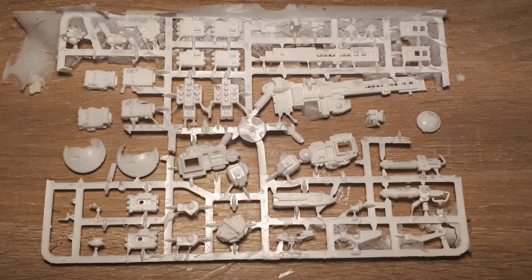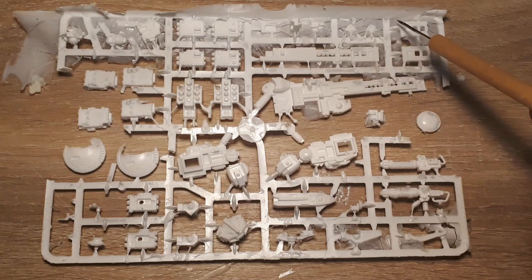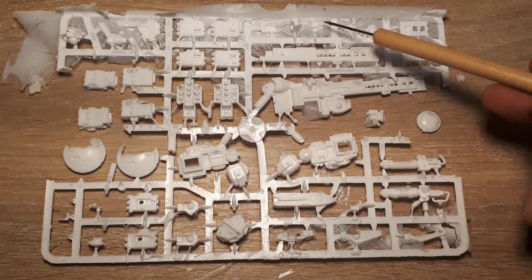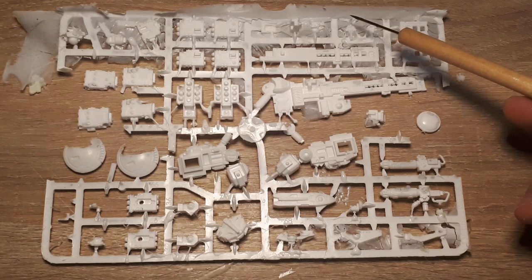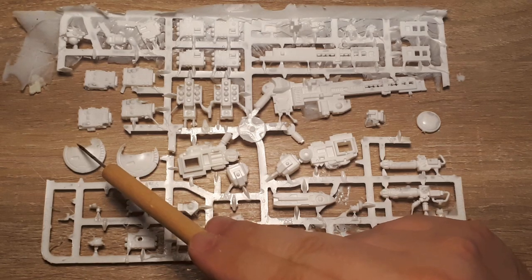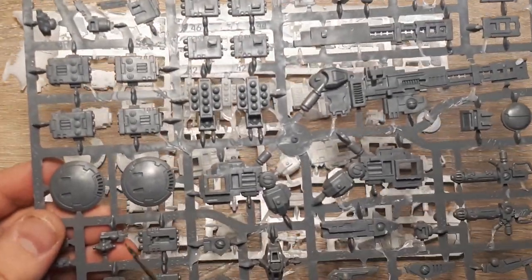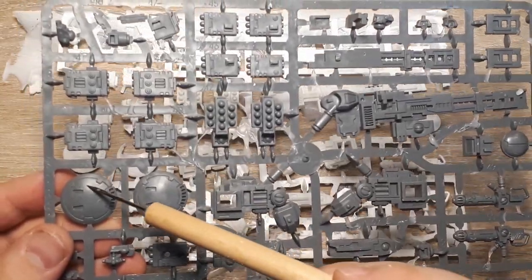I mean, honestly, look at where the bubbles have formed. Here's the top of the sprue. This is where our hot glue was holding it together, which means that becomes the top of the mold once we demold and start pouring the liquid plastic. We have a giant bubble right here, a giant bubble right here. And if you take a look at the corresponding place on a sprue, you can see there's the pocket of air. There's another one.